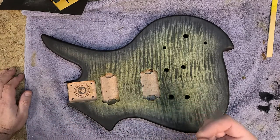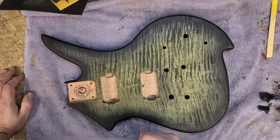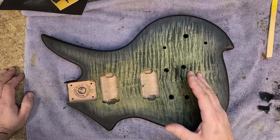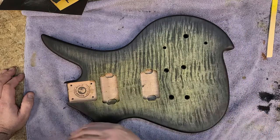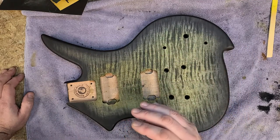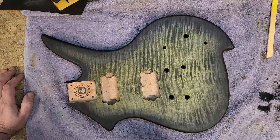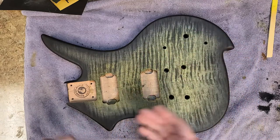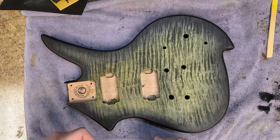What I did is I had a little bit of a yellowing dye — not much — and I kind of went over the whole top of it with a brown. I went over the back with dark brown, sanded that back, then hit it with some black on the top and sides, giving it a little bit of a bursting look around the edges. I sanded it back down, which gave me darker stripes and brought out a little more of the yellowing. It kind of looks a little greenish but it's not.